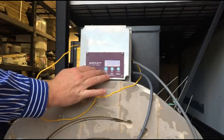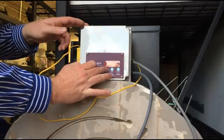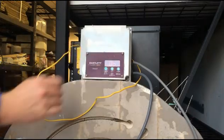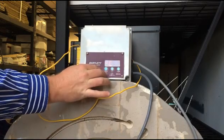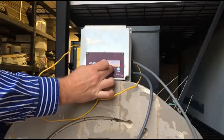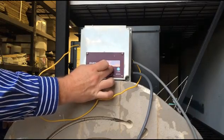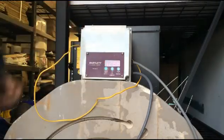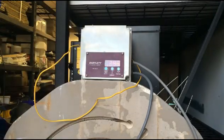For this particular model, we press and hold the start/stop/enter button, then we turn the power on. We hold it until it says 'edit' and we let go. We then press enter again and it comes up with either C or F — C for Celsius, F for Fahrenheit. Once you've made your choice and you're happy with it, press enter. It'll go to stop, back to idle, and display the current temperature. This one's still a little bit hot because the kiln was running a few minutes ago.